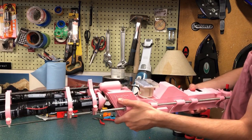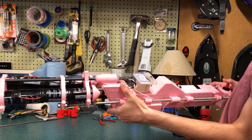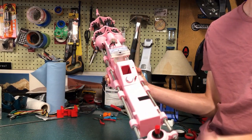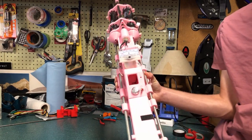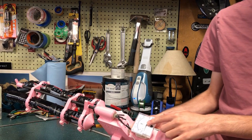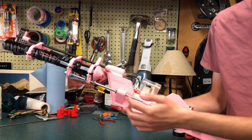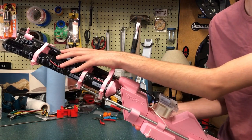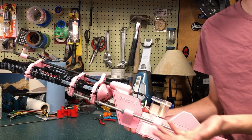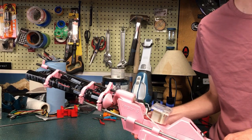Overall this device is pretty similar to the most recent other one I made — the green one in the other video — but there are some important differences. One: it's triggered with just a barbecue piezo igniter instead of a whole high voltage circuit, which makes things a lot simpler and easier. It has a voltage monitor, which is very useful — it was going to have a battery voltage monitor but that broke and I don't have time to get another one. It's also got a bleed resistor so the charge in the capacitors will slowly leak out over the course of about 15 minutes, which is very helpful for safety. If it doesn't go off, I'll just wait, it'll go down to no charge and I can start working on it again. I've had to use that many times.